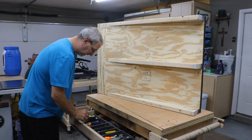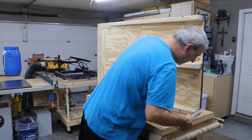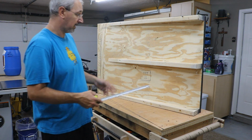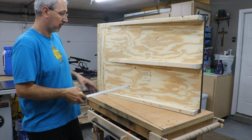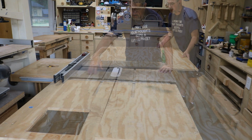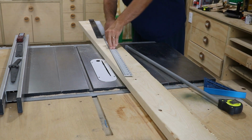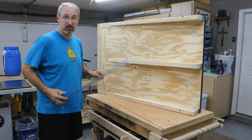So the bottom was just, I think it was a 2x6. Yeah, a 2x6 in my case, because I only had like, I think it was a 5-inch rise. So technically only needed a 5-foot run. And what I ended up doing was making it 48 inches, which is the width of a piece of plywood, sorry. And I made it 32 inches wide.